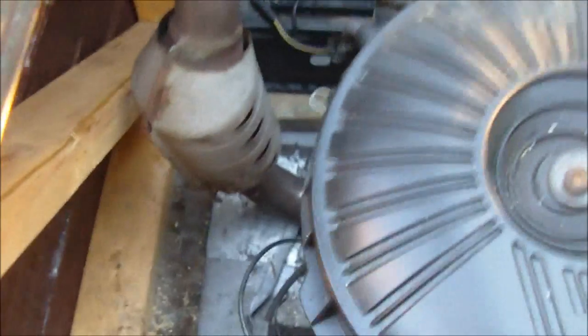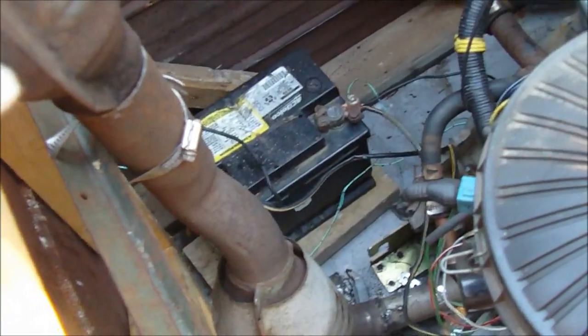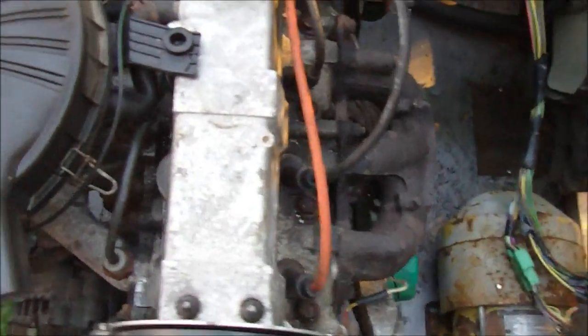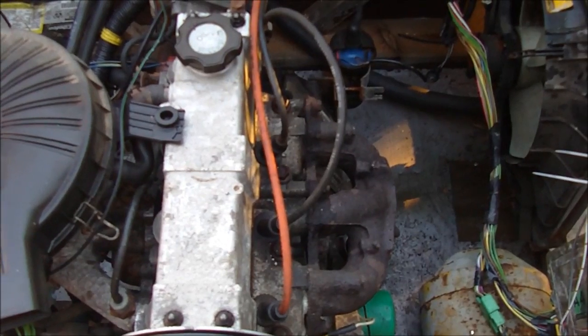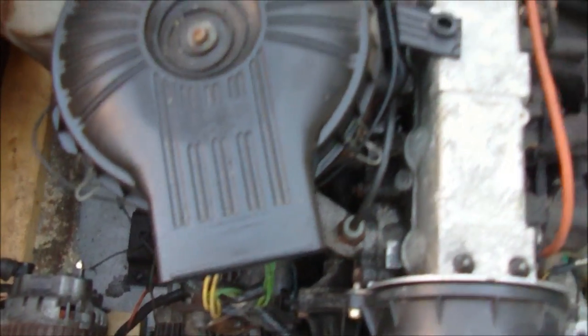It's starting to idle down. The exhaust — I just welded this; it was a cat but it's been pounded out, the actual guts of it are gone. I have to weld the catalytic converter so the exhaust comes out of the top, and then I can cut a hole and drop this in when you get to the job site, which will keep the actual height of the generator low. I still have to weld this muffler onto the cat, so you can see it's leaking. I built this generator because I wanted a really quiet generator to provide 12 volts to charge battery banks and also some 120 volts — or I can just put some inverters in here and get 120 volts off of that.